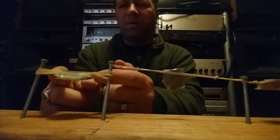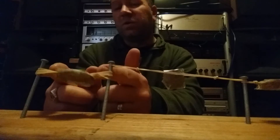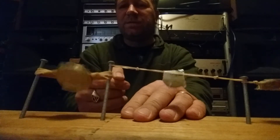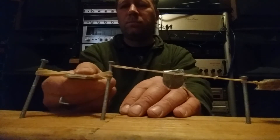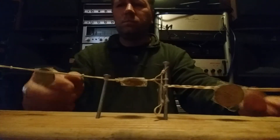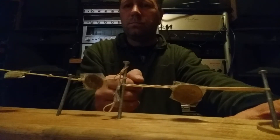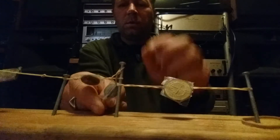The 18-inch has a bigger space and a double rubber band, and the reason for this is to show higher damping. With higher damping, the movement is not as big or as long — there is more control to it, compared to the lower damping examples. Then we can put the little 8-inch back on to compare.